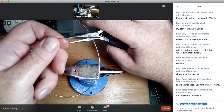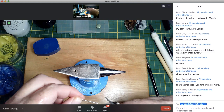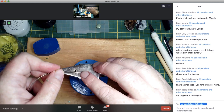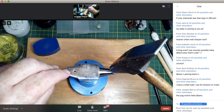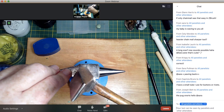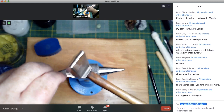And so I'll say, we'll cut the tip in a little bit here with a, God, I'm shaking so much. So I'll often forge a spatula. You don't have to do this. What you could do is use a thinner wire, but then I don't get the nice thick wire. And so I will often forge the shape myself. If it's a one-sided blade, I'll hit on one side of it and try to flatten out one side. If it's a two-sided, I'll just make a big flat spatula. And so today I'm making a two-sided broadsword.